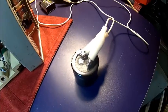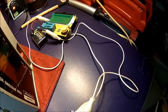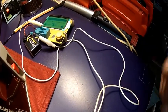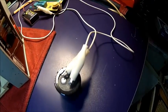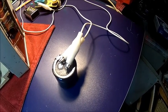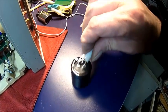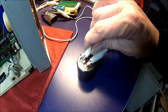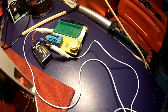This is a 10,000 microfarad 25-volt replacement, and it tests fine as a capacitor — it hasn't got that diode effect. This testing gizmo here is not 100% reliable, but if it says it's a capacitor, it's a capacitor. If it says there's a diode in series, it's usually a bad capacitor. Just swapping the wires to double check — yeah, it tests the same. It's a salvaged one as well, not the youngest anymore.